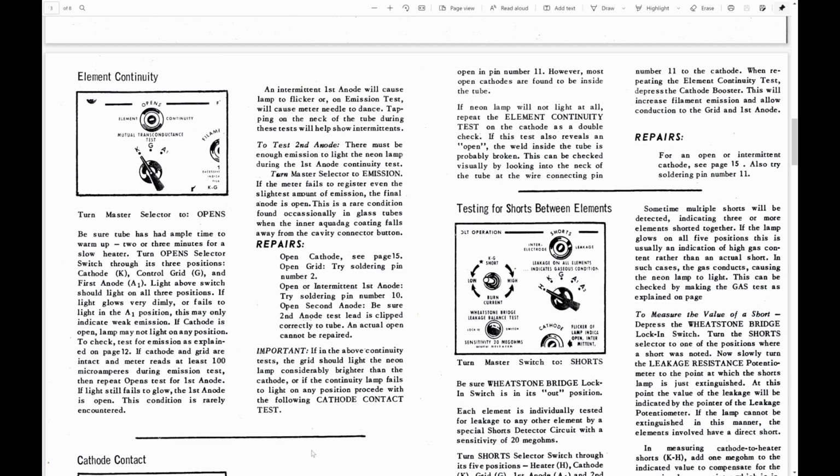So yeah, that's one very distinguishing feature of this versus other picture tube testers: this puts voltage on A2. This puts out several thousand volts. I've never seen any other tester that put any voltage on the second anode, and even on the first anode, they only put a few hundred volts. They don't put several thousand volts. So it's probably enough to actually light up a spot on the face of the CRT, certainly on a strong CRT.